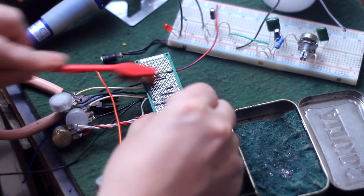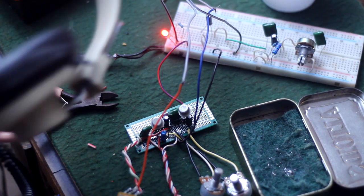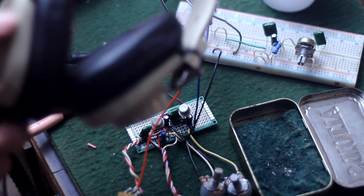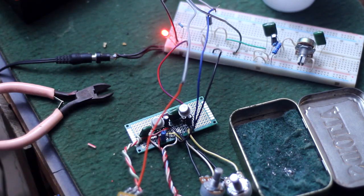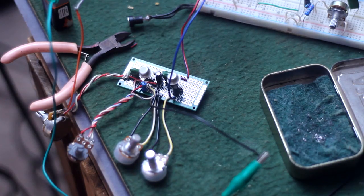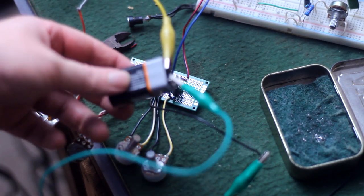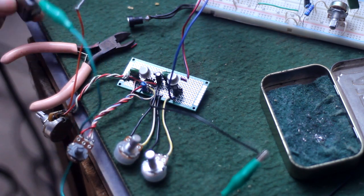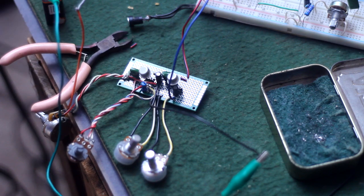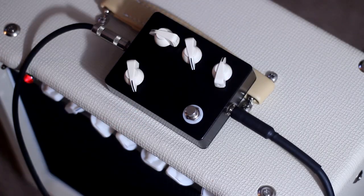As a testament to that, I popped some transistors in it and hooked it up to the breadboard. It passed audio perfectly. Sorry, no sound on this clip. I had to use headphones. My wife was asleep and she goes to work before daylight. So then I tried it independent of the breadboard, running off a 9-volt battery. And as these circuits often do, it sounded much better, much quieter. Much better biasing. So now it's time to start figuring out how we're going to box this thing up.